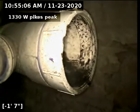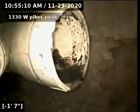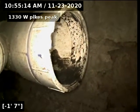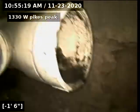All I do recommend at this time is to snake every 9 months for preventative maintenance. Video every other year, every 2 years, just to keep an eye on that clay. But everything looks good. Those are my recommendations.